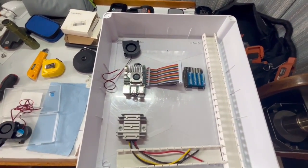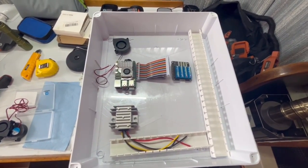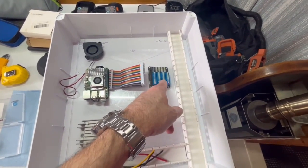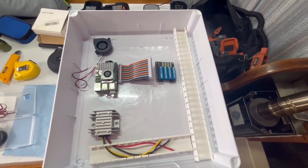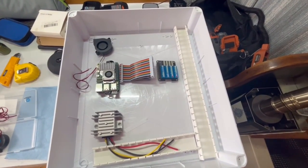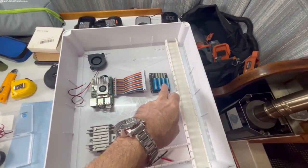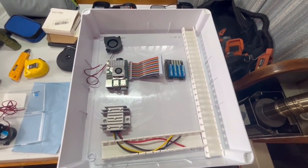I'm going to put proper connectors on the inside bringing out the HDMI, power, USB connections for my GPS puck, and all the other connections I need. All the wires from the GPIO breakout — there are I2C sensors, a sensor for the flux gate compass, heel and trim, the wind sensor, and the depth sensor — will all connect here so I can program Signal K to get all that data on my display.